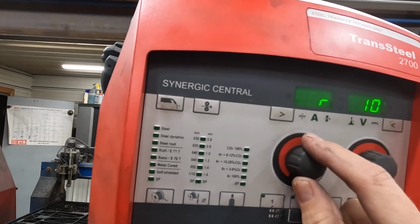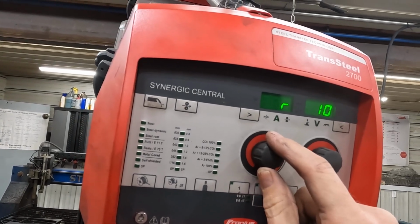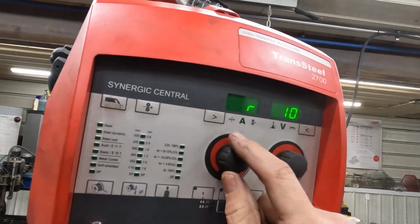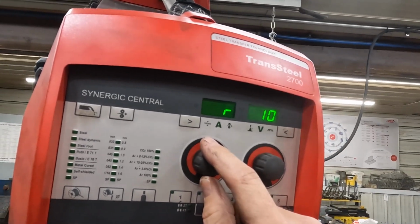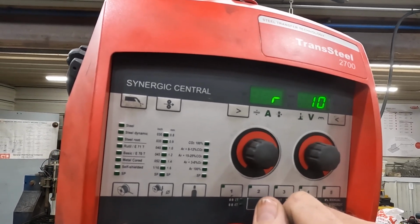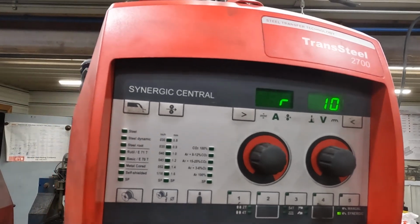One of the nice parts on this is you can do a resistance check. What you can do is you go through and calculate, it'll basically calibrate with ground length and contact and that kind of stuff. It helps if you've got multiple ones of these to be consistent. So if you've got 3 machines and they're putting out differently, then it's definitely worth doing a resistance check to bring them all back into a standard calibration.